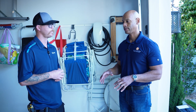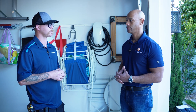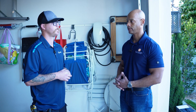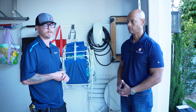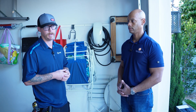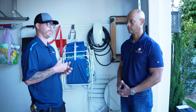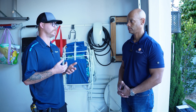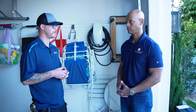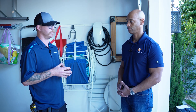Now, a lot of homes here in Los Angeles don't use large central air conditioning units. If they wanted to, in theory, could they run an HVAC compressor unit on this critical backup panel or do you stick to 120-volt loads only? The Gateway V3 has a maximum locked rotor running amps of 110 amps. So as long as the AC comes in good on that calculation, the Gateway V3 and the Cybertruck can handle that backup load. But we try to veer away from that so they don't drain their batteries so quickly — those ACs will drain that truck within a few hours. We try to keep it essential and emergency type stuff: keeping the lights on, fridge running, Wi-Fi going, so they can do as they need for a long period of time.